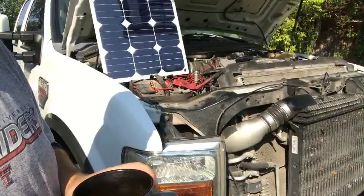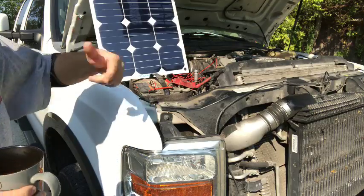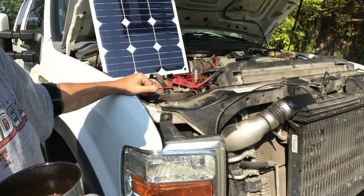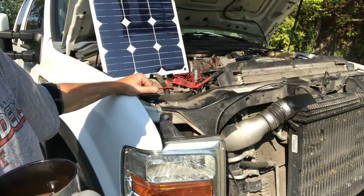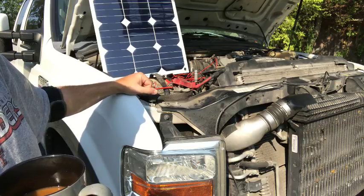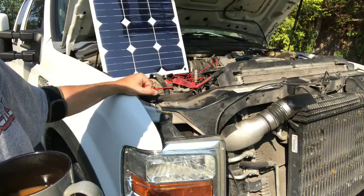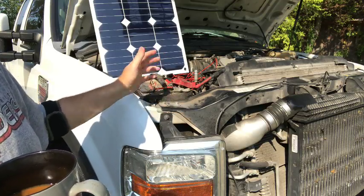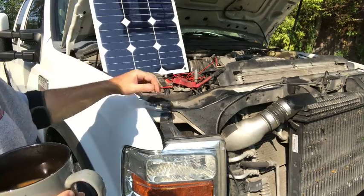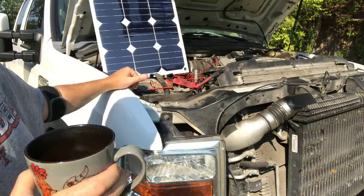Cannon Builder just asked, "What do I seal the metal with before I paint?" It depends on what I'm doing. What I did on those flags, the ones that had the white in it, is I sprayed the whole flag with white epoxy primer to seal the bare metal. If you're not an automotive painter, that's a two-part catalyzed direct to metal primer that needs a certain scratch depth in the metal to bond to. Then you have a recoat window, a window of time after that you can spray right on top of it without sanding it. For the one I use, it's 3 days. Some of them are longer, some of them are shorter.